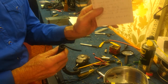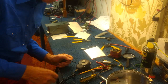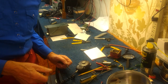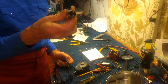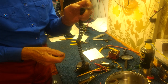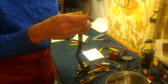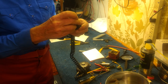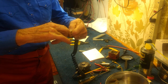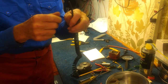Instruction one: slide the sleeve on the cord. Pay attention - even if you have done it 50 times, you are going to solder up everything and then forget to slide the back of the plug in. In this case there isn't much straight wire left before the spiral, so I'm going to slide this Switchcraft XLR4 body or sleeve on and pull enough of it through so you have plenty of room to work.